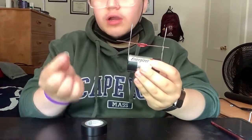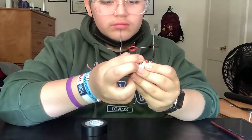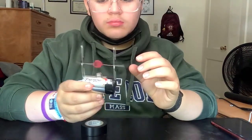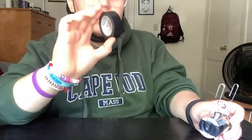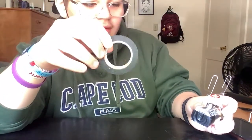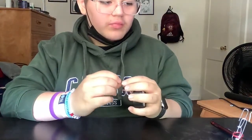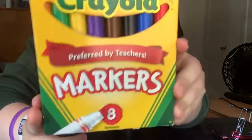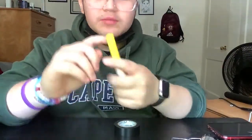When you do that, you grab about two neodymium magnets and place them in the center so it can spin. I just used any type of tape I found — I got electrical tape. For the magnet wire, it was extremely hard to find, so basically I looked on Amazon and bought it — 28 gauge. Then once I got it, I used the thick Crayola markers and wrapped the wire around them 10 times around the little cap so it could get a circular formation.